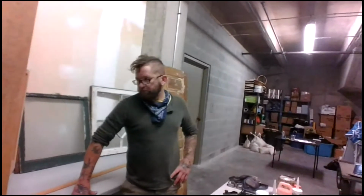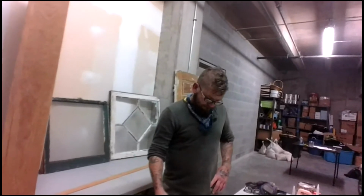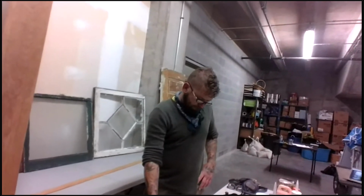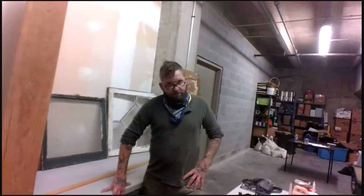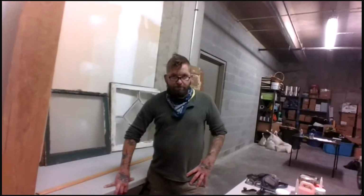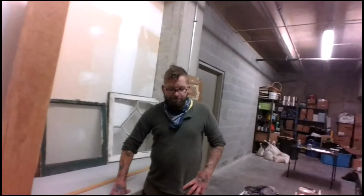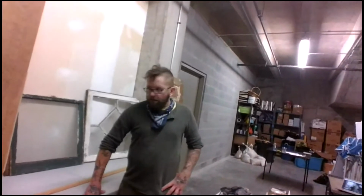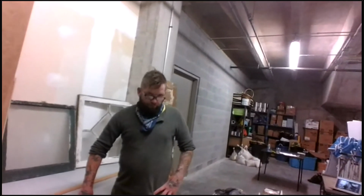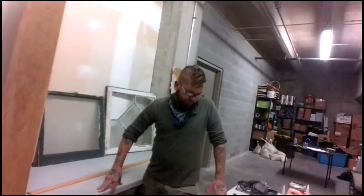Yep. Windows help, and we'll talk about storm windows a little later, but I get a lot of clients calling and saying, my windows are terrible and drafty and my house is so cold, I need new windows. I say, do you have insulation? And they say, well, no, but I want new windows. So they get the new windows, and then they call me the next winter and tell me my house is cold and drafty. So then they get the insulation. So you hear it here first, folks: insulation works. Make sure you take all those extra steps with your windows, though, to get extra bang for your buck.